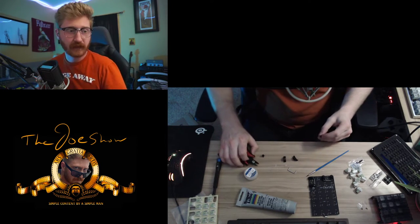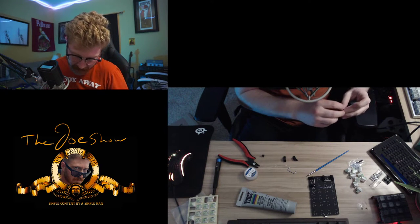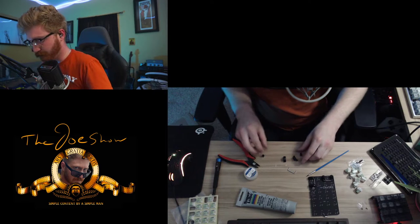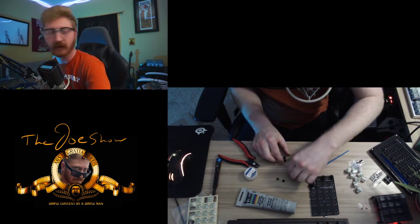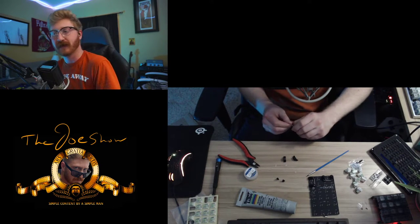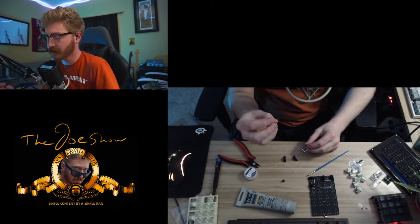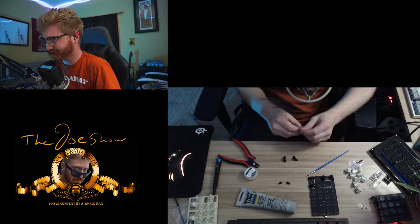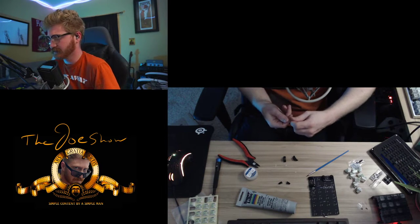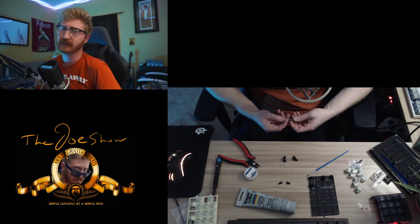Now, if this was a full size keyboard and you were actually typing on it, another thing I would do is Band-Aid mod the stabilizers, which is what would interact with flattening out this part. There is an argument to be made that if I've already clipped the stabilizer, there's no need to Band-Aid mod it.